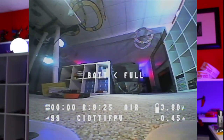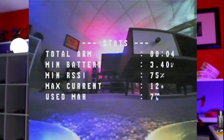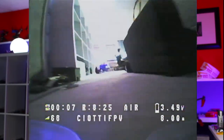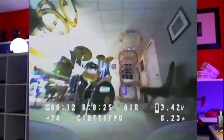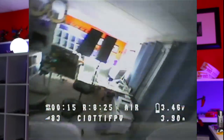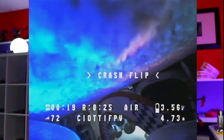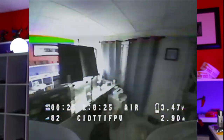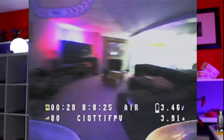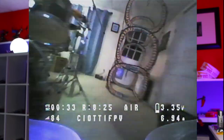Kevin Sumner says, is there a turtle mode power limiter in the CLI? I don't think so, because eventually it ramps up to full turtle mode. This just feels like some weird thing in the hex. My guess would be this is something weird in Blue Jay or BL Heli. I would like to maybe put this back to Blue Jay 0.16, and I'm willing to bet you that fixes the problem. All of these Blue Jay releases after 0.16 have seemed to have problems. I think this is on Blue Jay 0.2, which I tried, and it didn't fix the problem on the T motor boards.